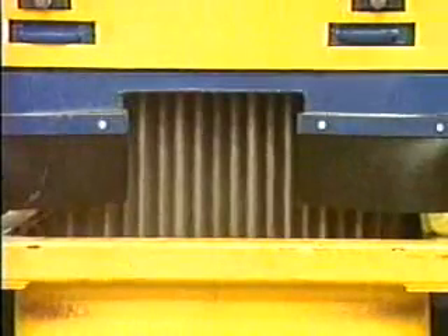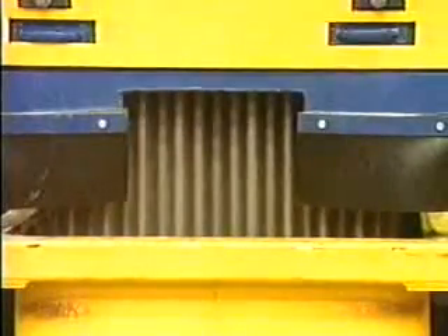The sand level rises as additional sand is rained in. Below the fluidized layer, the weight of sand above, together with vibration, causes the sand grains to move closer together, compacting them. The vibration and the flowability of dry sand causes densities of the compacted sand around the coated foam to be 10 to 15% higher than in other sand processes. Proper control of vibration and sand fill can ensure low foam distortion and full rigid backing of the coating. Some systems use synthetic mullite in place of sand to further improve cycle times and dimensional tolerances.